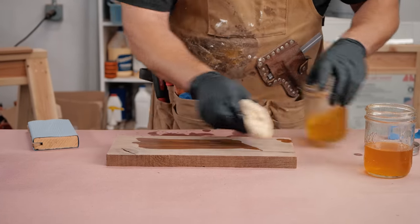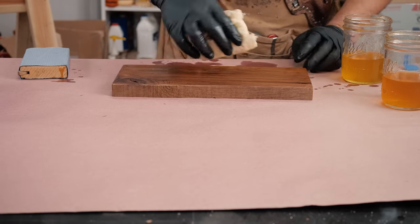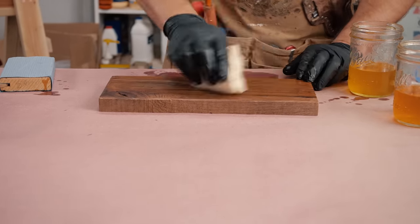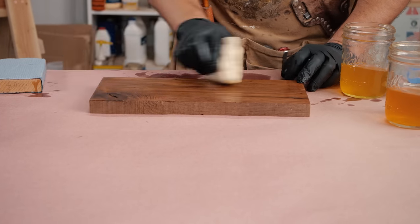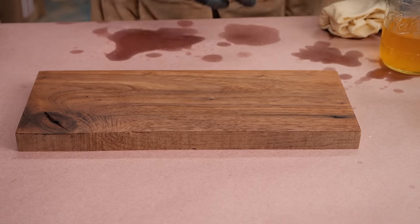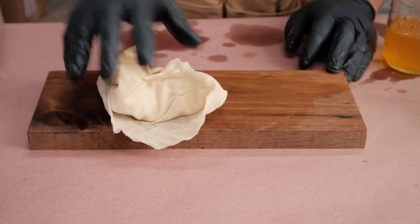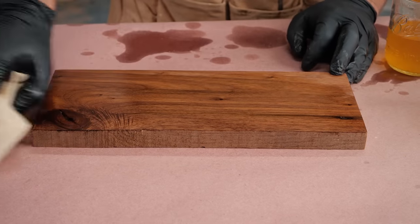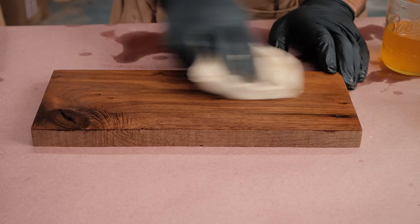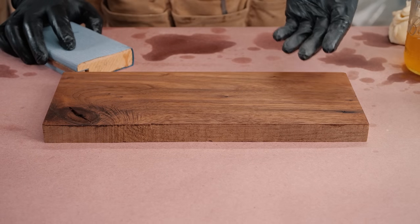So I'll add a few parts here and make it about one-to-four. Dunk the rag and just wipe it on — it's so easy. I'll just give it a coat. The great thing is it's self-wetting, so if you get a big glob that dries as a bubble, you can just buff it out and get it on there. You can tell it's dry when there's no more sheen to it when you look at it from the side. Then we're just going to do another coat — we don't want to completely flood the surface, as that'll mean more work down the road when buffing it out. And that's already dry — literally turned the camera off and back on 15 seconds later.